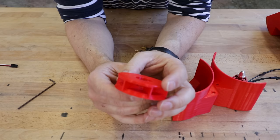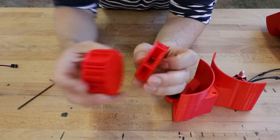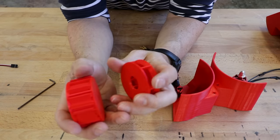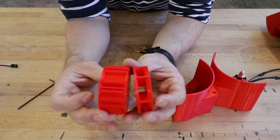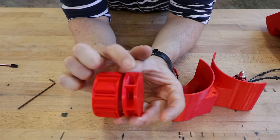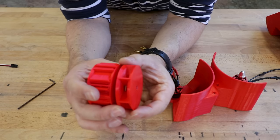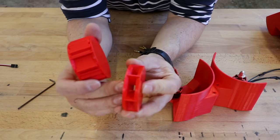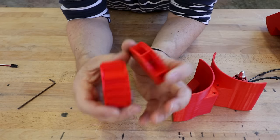This here is one of the paddle wheels that I've already cleaned. I had to print them with support, which is something I don't really want to do, but in this case I have no option. I have, as you can see, thinner and fatter wheels. I will start with the thinner ones because these have less mass and are going to be less prone to shaking and making the thing vibrate. Once we see how these perform we'll take the decision on which wheels to go with first.